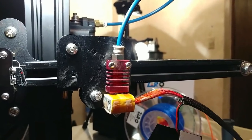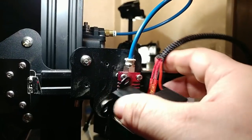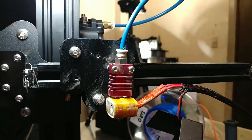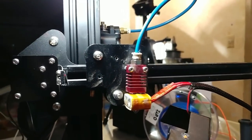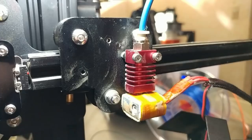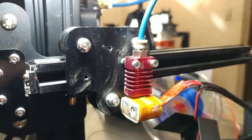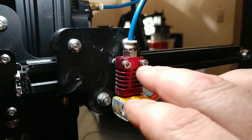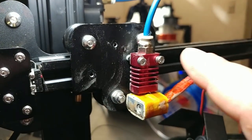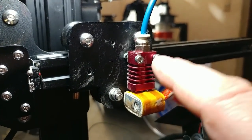That's it — reassembling now. Using my new M2 cap screws instead of those stupid little dome screws that strip out all the time. Nice shiny new cap screws instead of those dome pan head screws — they'll last a lot better, take a larger wrench, and don't tend to strip out nearly as easily. Every time I take any of this kind of bolt off the printer — especially if it has to be tightened — I replace it with a cap screw.